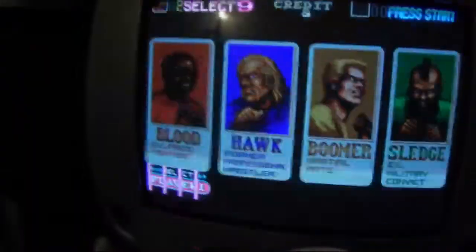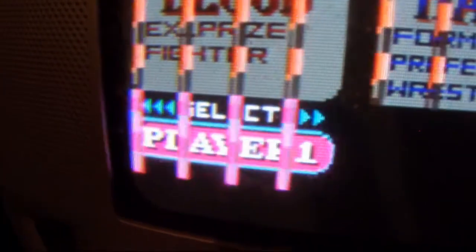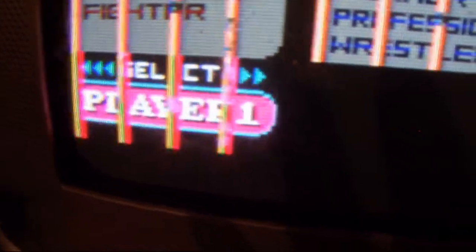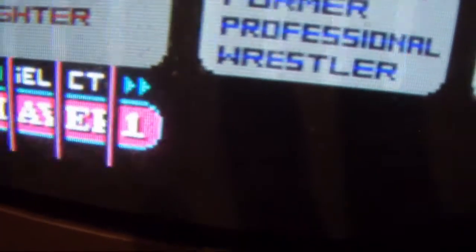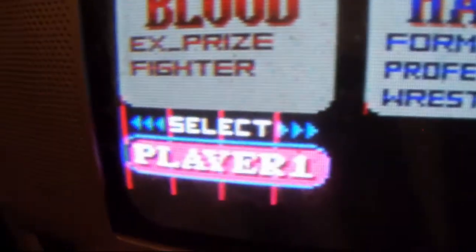So I'll shove some coins in again - if you watch down here you may be able to see something changing. I don't know if you noticed but there's no glitches anywhere on the screen now. All I've done is actually just laid this EPROM over the top of the original mask ROM and that works just fine - it just completely takes over the chip, and considering the one underneath isn't doing anything anyway it's not causing any harm.